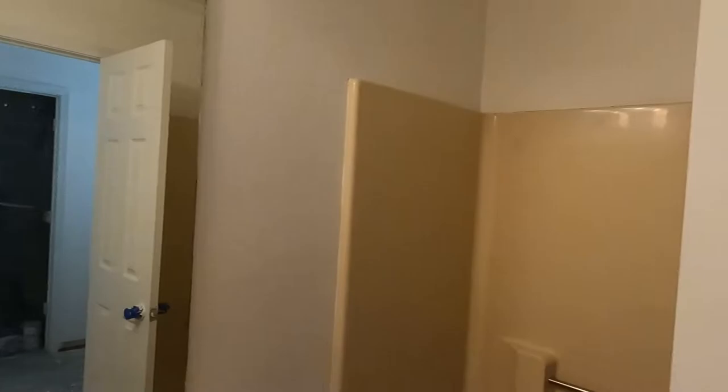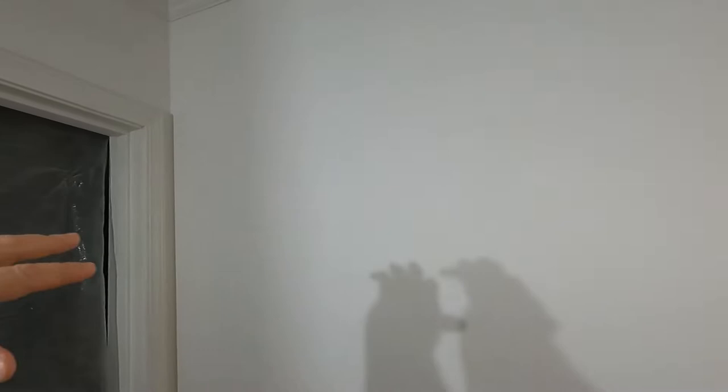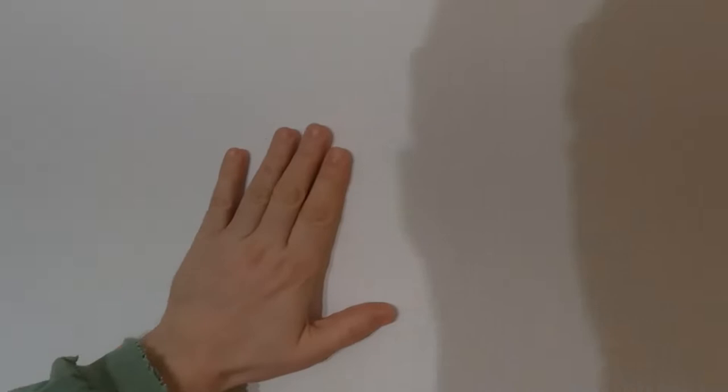What we've got going on right now — I'll take y'all to this front bathroom. Everything is primed. Did some drywall work on these corners — took a lot of work and time, but looking a lot better. Walls are primed; I've done one coat of primer. These had wallpaper on them — I pulled it off, cleaned it, used some fabric softener. That's a good trick to get wallpaper off. Done some mudding and sanding with 120 grit, so it's fairly smooth and in pretty good shape.